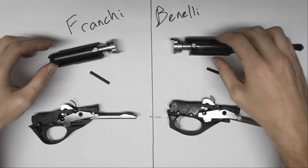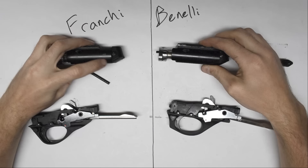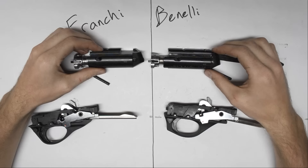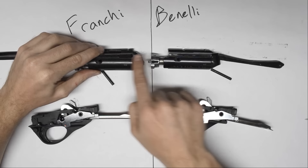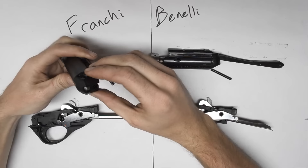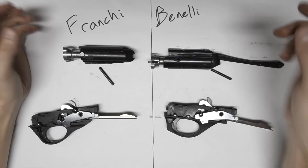Looking at the bolt and bolt carrier, they seem very, very similar — the finishes, all of it very similar. Obviously you don't have 'Benelli Inertia System' engraved into the bolt carrier on the Franchi, but the proof marks are even identical on both. I assume this stuff is probably made in the same factory. The carrier rails are slightly different in shape because the Franchi has to interface with its carrier differently, but overall it's pretty much the same shape. They take down similarly; the Franchi doesn't have a tail on the end, but it has the same style firing pin, same retaining pin, and the inertia spring is inside as well.